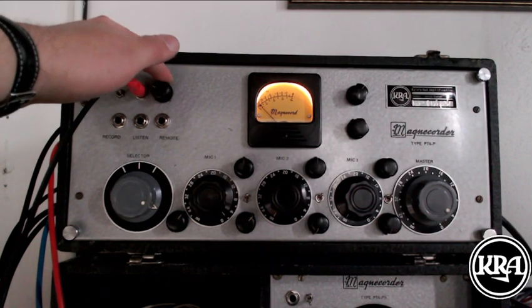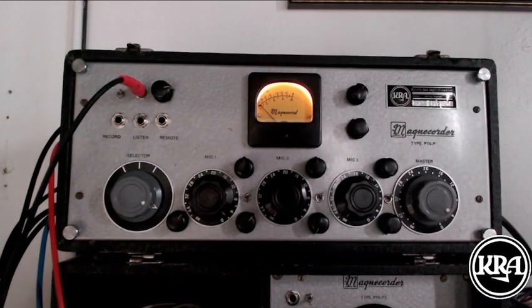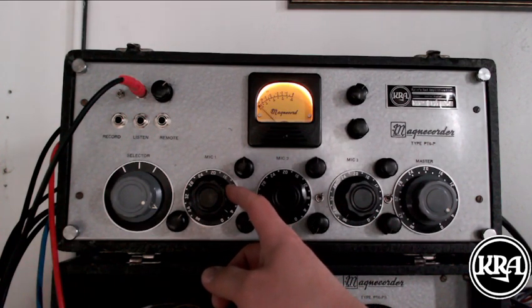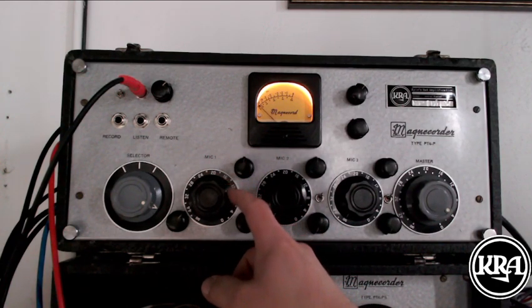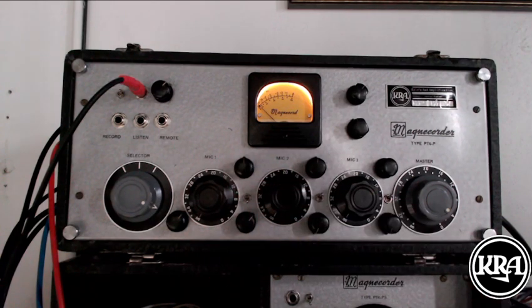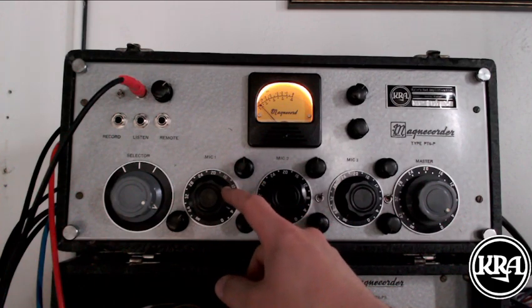So if I were to bring this up, we start to get the effects. I've got reverb set on my SP404. And yeah, you can blend it in to where you want it. If I were to turn down my voice, we should lose the voice and the reverb. Unless I were to flip the switch, in which case you'd still get my wet vocal through the reverb in the effects processing. If I switch it back, we start to bring it up.